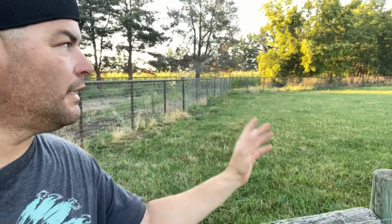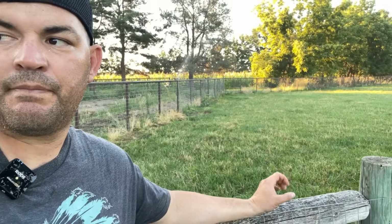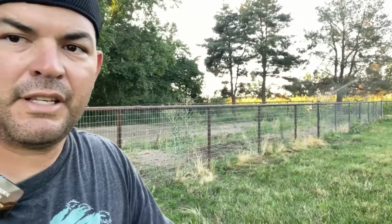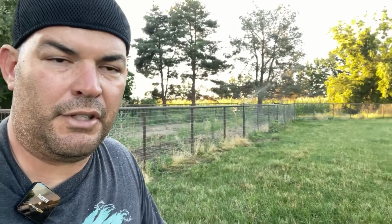From there, it goes to my 35A sprinklers. On this one string, I have 1, 2, 3, 4, 5, 6, 7 sprinkler heads. All right. Once it leaves the valves, it goes to 3/4 inch PVC, which I don't prefer. And then when it comes out of the ground up, it goes to some metal piping, and each sprinkler head has a ball valve that I can shut off, service each sprinkler head individually, and then shut it back on at each individual sprinkler head.